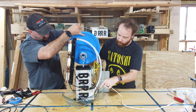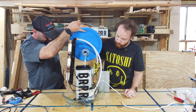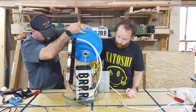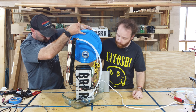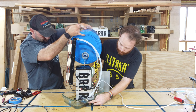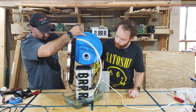Now we can also see that it's actually sealed, there's nothing that comes out at the bottom, that's good. And as soon as the Bitcool overfills, we want to continue filling it up, because we need some reservoir in the bottom of the pan so the pump can actually suck it up again. So we just continue until the pump inlet is nicely submerged. Just around now, we can stop.